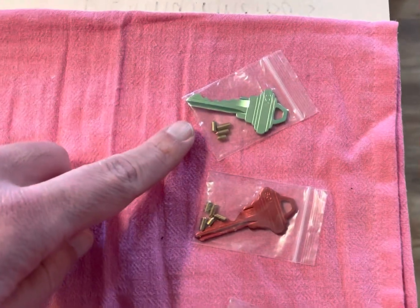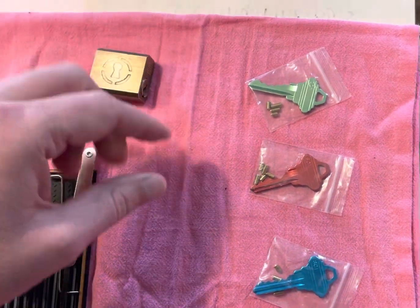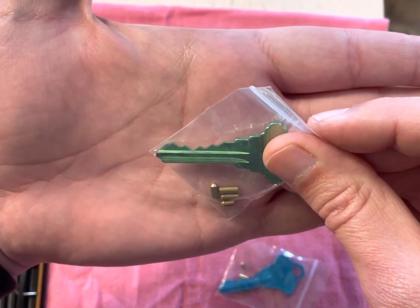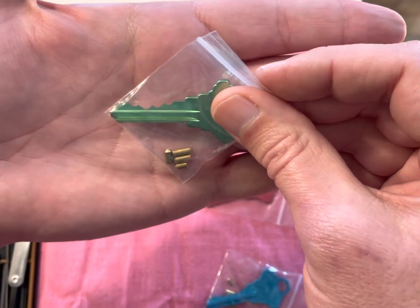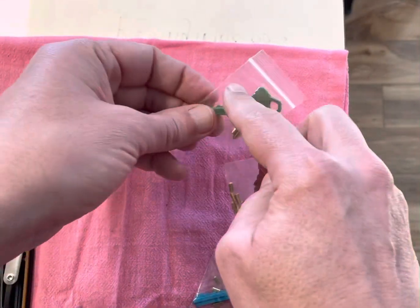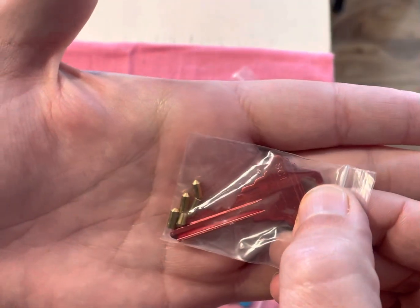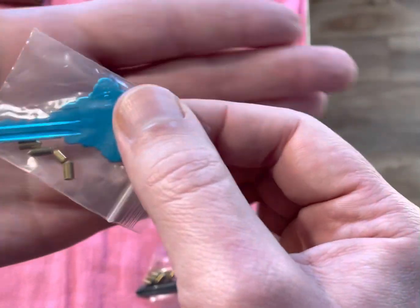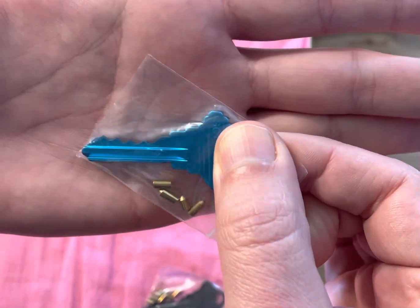These are the keys that came with the repinning kit. They're so that you can pin the lock differently and have a key, but what I didn't know — and I should have because it says it in the description — is that they're set with the bitting. So this is a low to high bitting. Notice it's progressive and the key steps down. The cuts get deeper as you move along, so it gives you practice on low to high. This one is high to low, and this one is low to high. This one they call a high rake or something like that, so it looks like they're all pretty much the exact same height, so I don't know that raking is going to be fun.